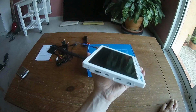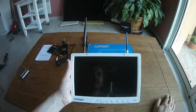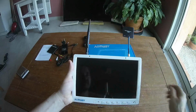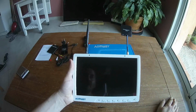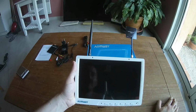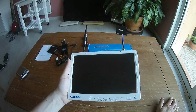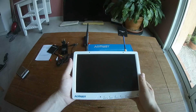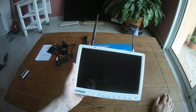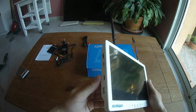Well, really I like it. The adaptation for the input source, either PAL or NTSC, automatically for both the live display as well as for the DVR. The built-in processor will adapt to the right standard and record everything correctly. What I like is the tons of possibilities of these two chains, the setting of the brightness, contrast ratio, etc., the possibility to flip, etc. Really I like it.